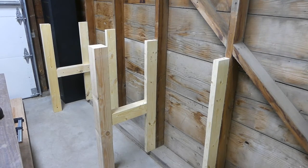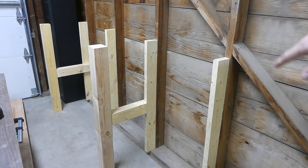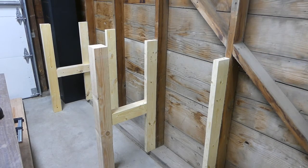I decided to make the bench 42 inches off the ground so I have plenty of storage underneath and can stand or sit with an adjustable bar stool type chair. I anchored 2x4s to the back wall to support a lot of the weight, and I put in just three legs so they don't get in the way of my storage. I then put in a couple of cross braces with metal angle off of the 2x4s on the wall. I also put metal angle braces to support the shelves because they'll have a lot of weight, and they're going to be made out of 2x10s.